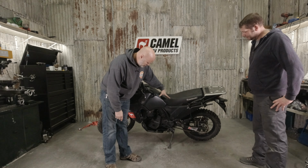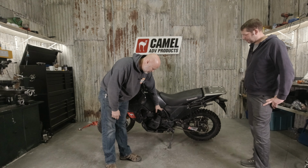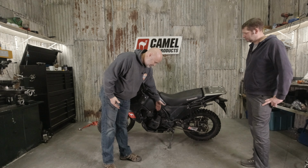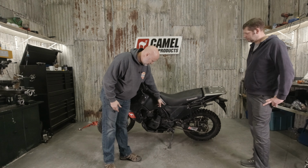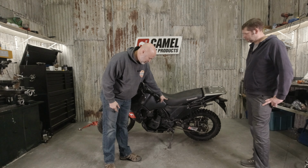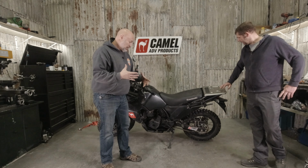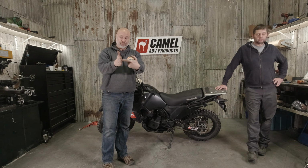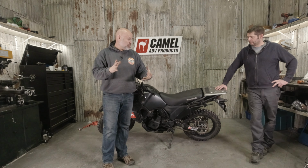so we're tipping it that way, where do we attach? On one bike, maybe there's exposed frame rail here that we can tie around, but on the next bike, say it's a KTM 990 that has the big tanks and everything, there's nowhere to grab onto. And the next bike has a tube available up here, and the next one's down there. So that's really important too, because where we're pulling from on the scale changes that number because of leverage.